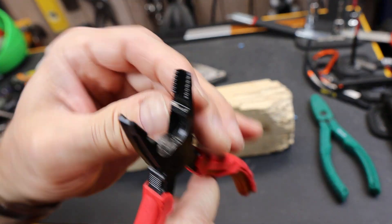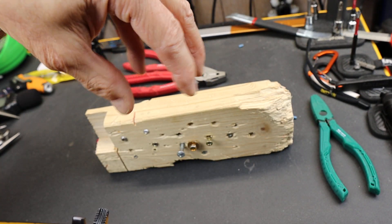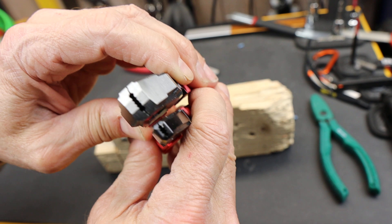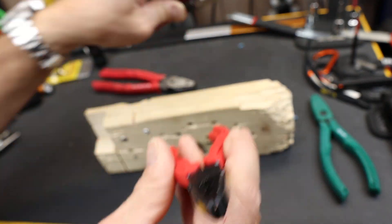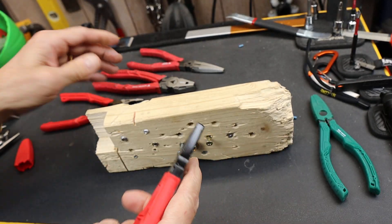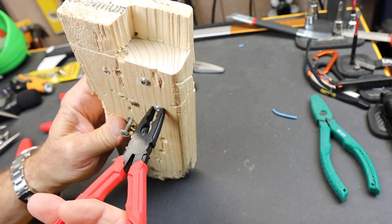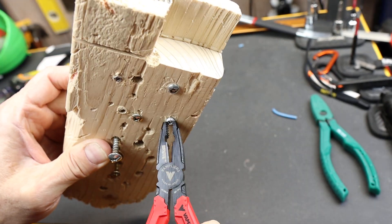The way the ridges work — they have vertical ridges in here. Those vertical ridges actually grab vertically, grab the screw, whereas a lot of pliers would grab sideways and you just slide. It also has a gap, and that gap is kind of one of the critical measurements that the different pliers have. They change in terms of the width of the gap and the arc of the gap. Pop this one open so you can see how those compare — it might look like a small difference, but in reality it makes a big difference in what radius of screw you can grab. As long as there's a little bit of vertical, I can easily grab it and twist it. No problem.